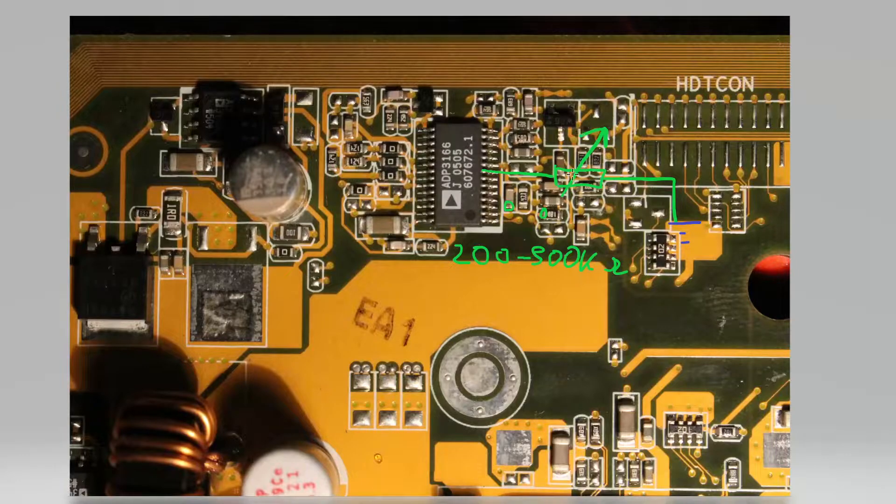Ground points: this side of this capacitor, these here — but I would not recommend using these here because I'd rather put MLCCs on there. This is VCore. There is also a screw hole over here.